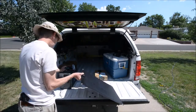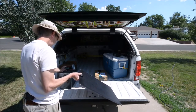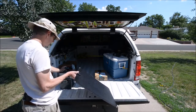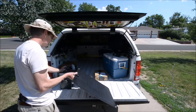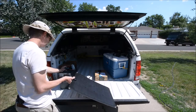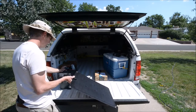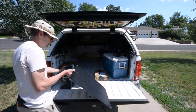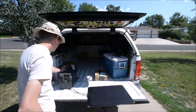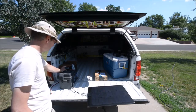So right now we got full sun. 15, just over 15, almost 16 watts. 1.1 amp charge rate. So I just wanted to show what it's really doing here, which ain't bad. It's still doing this battery fine. Yep, it's holding steady at 15.6, almost 16. Then when I lay it flat, it goes down to 12.4, 0.91 amps. So very good info to know.